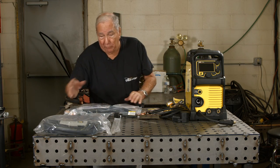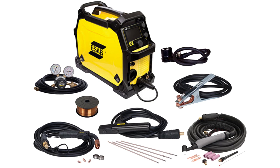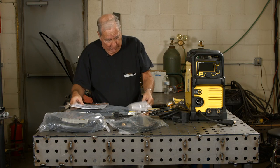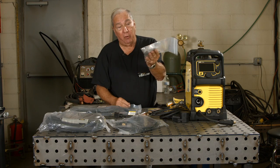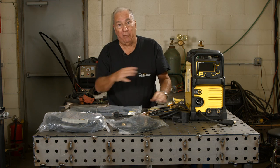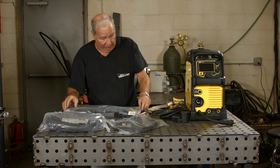It's multiprocess, so besides the wire, you also get a sample pack of stick electrodes if you're going to use it in stick mode. You also get the stick electrode holder, and if you're going to use it in TIG mode, you get a TIG torch that comes complete with collets, collet bodies, nozzles, and tungstens — everything you pretty much need for your TIG welding application. With MIG welding you also have a drive roll kit with a couple different sizes for various wire sizes. And of course, you have your MIG gun.